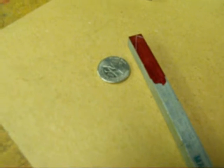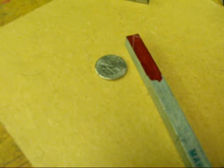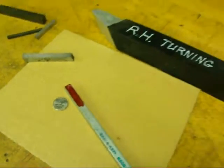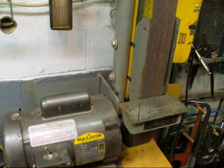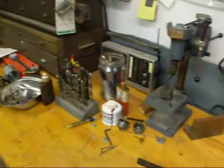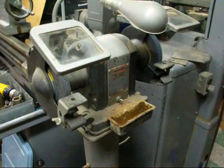It's easier to maintain a nice smooth surface rather than facets like a diamond — you'd like it all to be nice and smooth. Now it won't really hurt your high-speed steel if you overheat it a little bit; it's not like regular tool steel, it can take the heat. I often prefer to grind my bits on a belt sander. This is a two-inch Kalamazoo. If you don't have one of these you're committed to using your grinder, and I'll use this little Craftsman here.